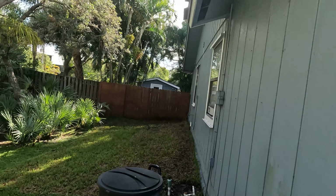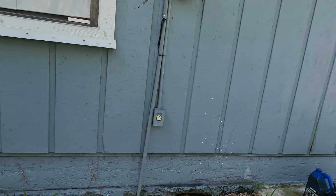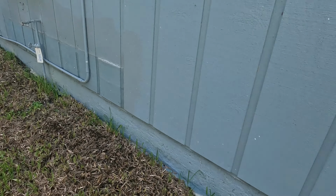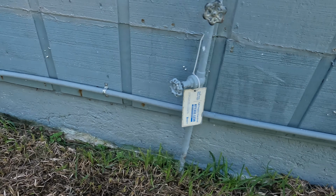This whole wall right here is going to get replaced within the next day or so. I'm not really in a big hurry, but I'm going 24 inches up off of my bottom line, and that's where most of the damage gets done. As you can see right here, basically it's moisture. A lot of it's probably my sprinkler system that I've allowed to touch the bottom of the house. But also, when we purchased this house, someone had done, I wouldn't call this a very good repair. They splashed in about 12 inches worth of replacement siding, and you can see it's pretty soft.